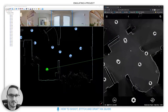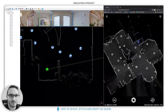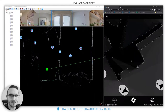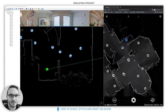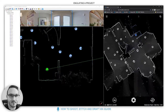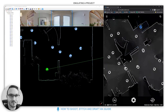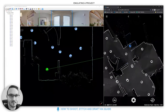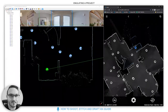You can see fill data with different shapes and shades — this shows how much of the area is filled in. Completely black areas indicate missing data. For example, completely black walls likely mean there's a fridge in the way and that data will never be captured. This is a great indicator to check: look for any black data and you probably need to fill in that area. Some black areas like stairs, under-stairs, or wall beams are expected.